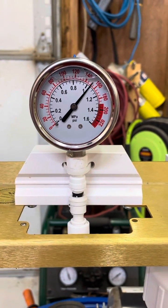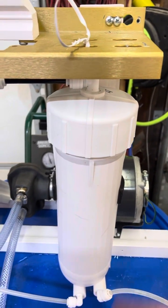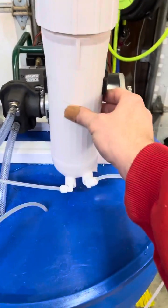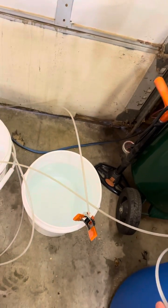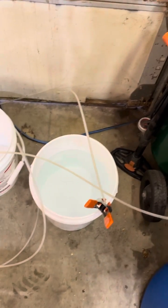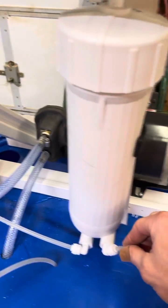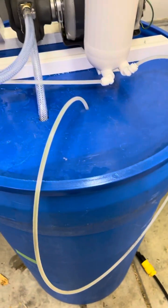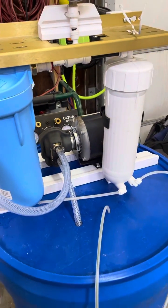We are running right in the 150 PSI range. Moving over to the reverse osmosis membrane — flow is coming in and going through a four-inch by 12.5-inch membrane. The permeate water, which in normal reverse osmosis is the water you'd want to drink, is in this case the water we want to get out; we'll use it for cleaning or maybe taste it. Then we have the concentrate line, often called the brine, which we restrict to get higher pressure to encourage flow across the membrane — that line comes back in at a more concentrated level than where it started.